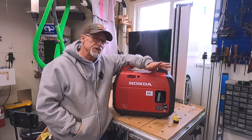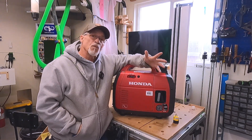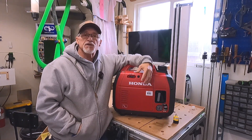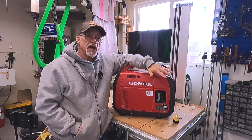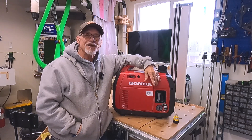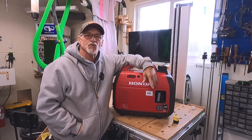There's not a lot of resources on YouTube I found for this particular problem. My goal for this video is just to bring a little bit more awareness that just because you've got a nice generator and it's got a floating neutral, don't think for a minute that you're going to just plug in your furnace and it's going to take off. It doesn't work that way.